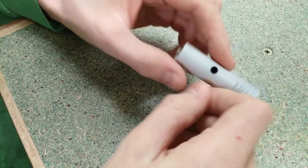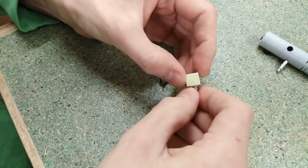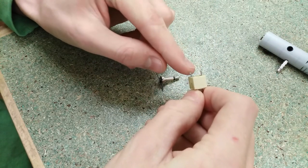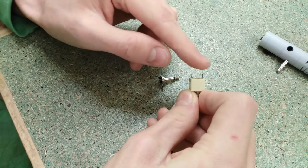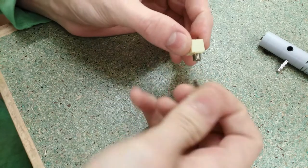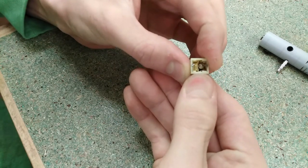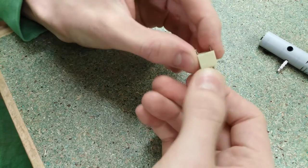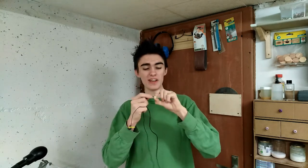The trick behind this plug and play system for the two microphone capsules is actually the big mono audio jack. So it's got an additional contact down here, and if there is nothing plugged in, these two pins are connected. But once I put in the plug, it pushes away this springy contact, and now this pin's connected to the tip of the plug rather than the other pin. That is how it toggles between its own microphone capsule and the one in the lavalier.